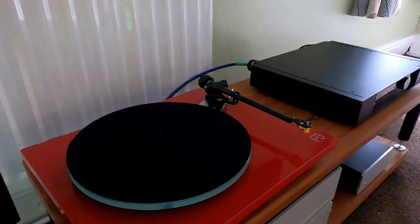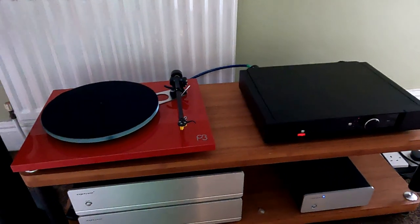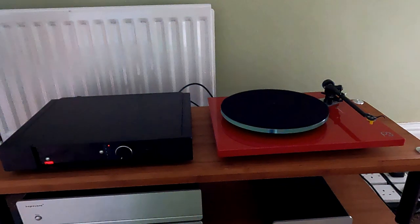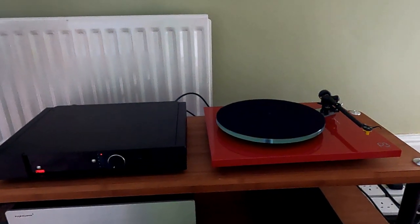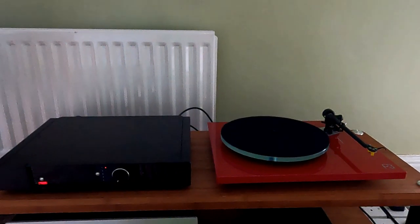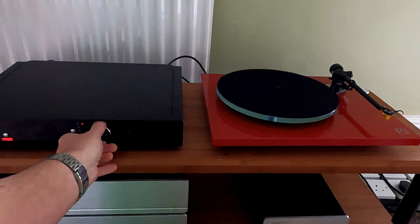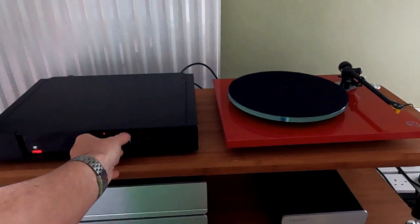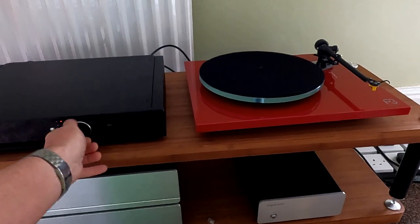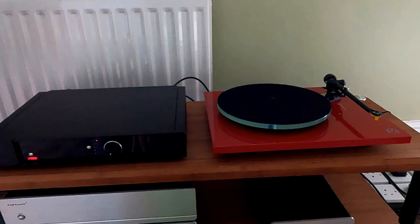Easy solution to this, which will make it even quieter actually, and the way to do it would be, I'll just stop the camera and I'll show you what I mean. Right, so a simple solution is I've just turned them around, so now the transformer is up this end, the tone arm is up that end, and that sort of distance means that we're now fairly well noise free. You do quite often get a bit of background noise with record players, but little things like this will take the main noises you can get rid of, really.